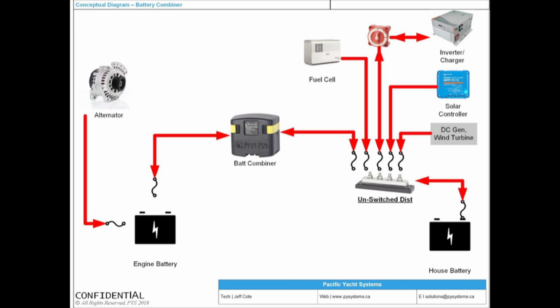It's sort of a replacement for, back in the day, boaters used to go off, one, both, all, two, and they would turn the switch to all whenever the alternator would be running. Manufacturers like Blue Sea has one, BEP has one, Mastervolt, everyone has one, right? Xantrex has it. They call them VSRs, voltage sense relays. They call them automatic combiner relays. They call it Echo Charge. Everyone builds one.